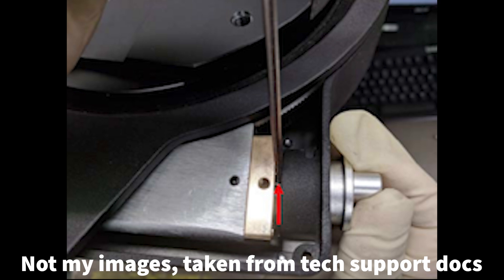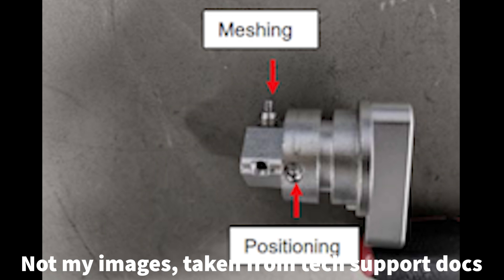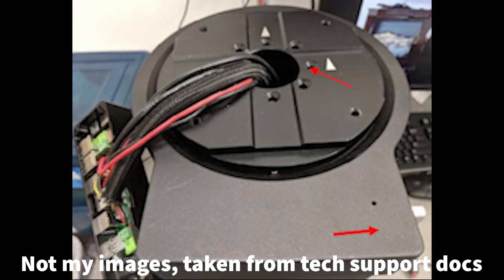My first instinct was that the holes in all the plates were wrong, but I knew that going through a factory everything was already set, so I doubted that could be the problem. So I went ahead and removed the entire switch from the mount, and a little ball bearing popped out in my hand — which I was expecting, but it's still a little nerve-wracking because I have none of these spare parts. If I lost a small part, that meant waiting weeks for replacement parts from Ioptron. I put it back in the way the instructions said and slid the dec cover plate back over just to see if I could access the hole, and everything lined up perfectly.